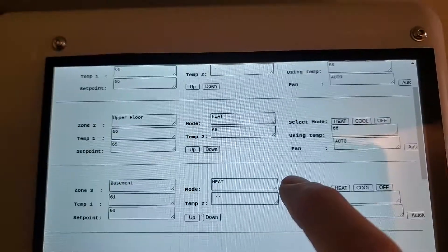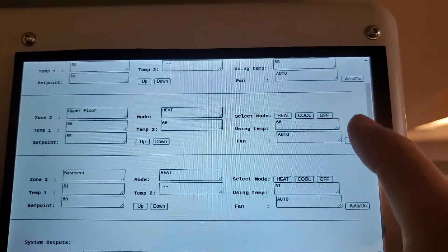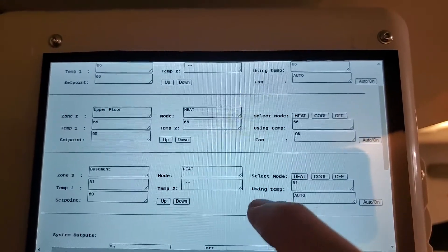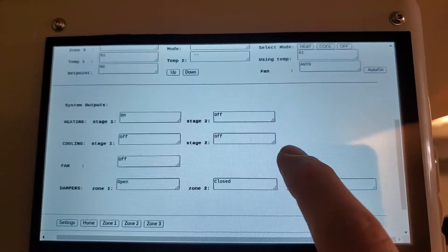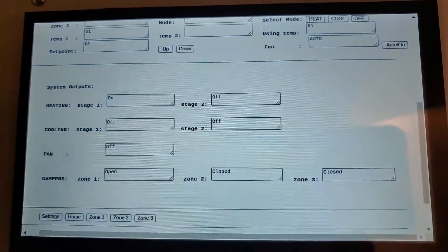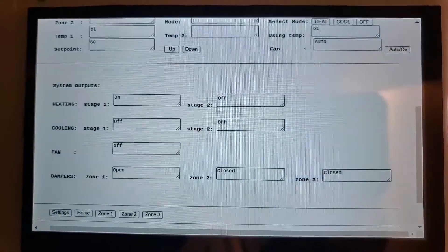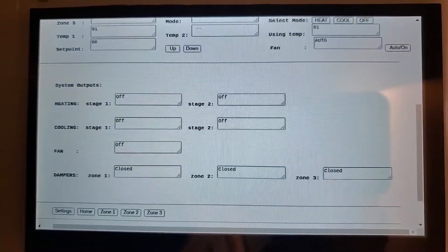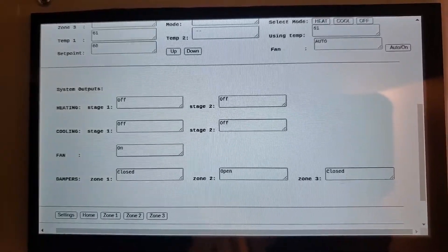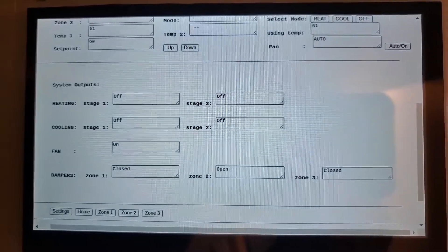I think I'll turn on — let's say I just want the fan on zone 2. So it's going to wait until the delays are over, shuts off the heating mode and closes this damper, then it will enable the fan and the zone 2 damper. Zone 2 damper has opened and the fan has been commanded on.